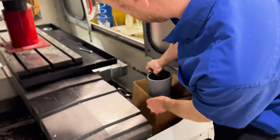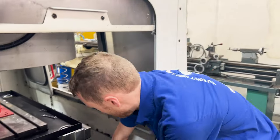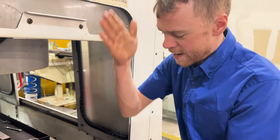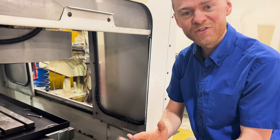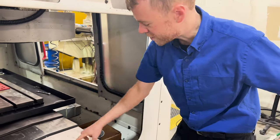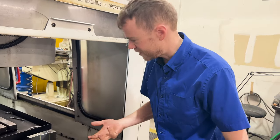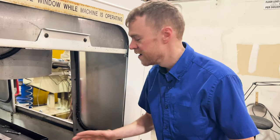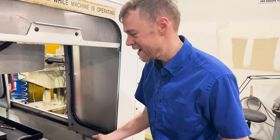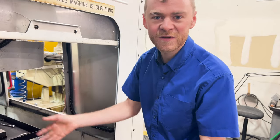This is what I usually do — I'll put the chip auger inside the machine. One time we put the chip auger in a cardboard box in a horizontal position, then ran the head down on a block of wood and didn't strap the head. Well, the trucker slammed on the brakes, the X-axis went flying over, crushed a way cover, crushed the chip auger — it was our fault. So we had to buy a new way cover, a new chip auger, fix a bunch of stuff. Thankfully the spindle was fine. So putting the chip auger inside is both a good idea and a bad idea — good that you don't lose it, bad that stuff rolls around and you could damage something. I'm going to put it in there until we get it on the trailer, then I'll put it in my truck.